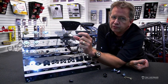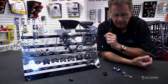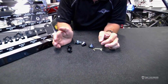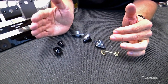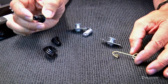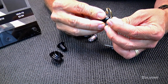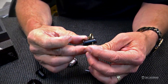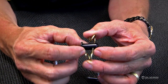Along with that, you've also got a depth number that you need to be concerned with. I've laid a few of these out here loose because the depth is important to get your spring and your fastener matched up. If you have too long of a stud in there, when you tighten it down and it goes together like this, it's not going to tighten up because you've got too much material between the panel and the spring.